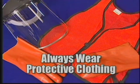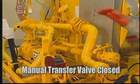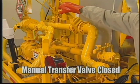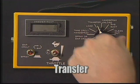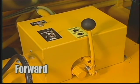Protective clothing is recommended for this procedure. Be sure to wear gloves and a face shield. Do not smoke during this or any other procedure with the RMT. When the material is ready, make sure the manual transfer valve located here is closed. Also, make sure the left and right bar valves are closed. Switch the in-cab controller mode selector to transfer. The pump direction control lever should be set to forward.